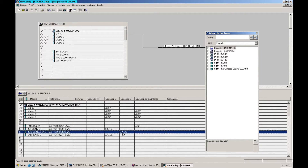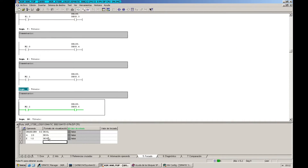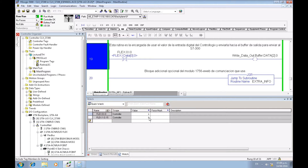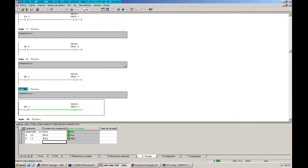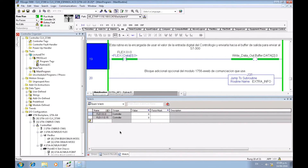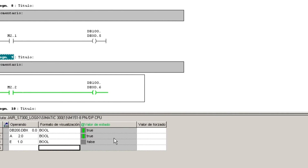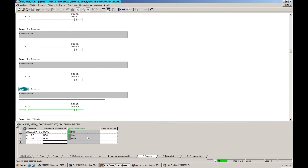This is the digital output — I'm going to test the connection between ControlLogix and the S7-300. I'm using a MSG block and I can see: true, false, true, false, true, false — true false cycling. I'm sending the message via Ethernet to the Siemens PLC. Great, it's working!